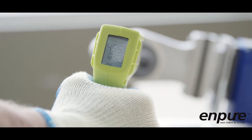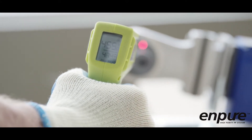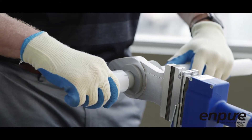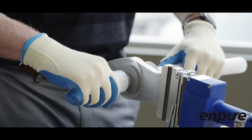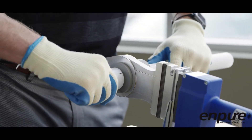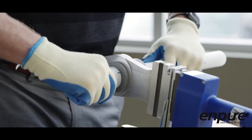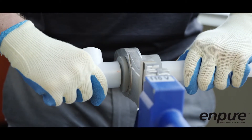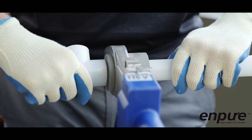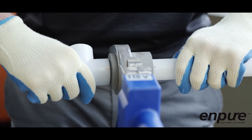Overheating or underheating of the pipe and fittings may result in poor fusion. Simultaneously engage both the pipe and the fitting with their respective bushings to determine interference. If substantially more resistance is offered by either the pipe or the fitting, begin your insertion with just that one item. Start the insertion of the second item once the first has reached the bushing half point. If the same resistance is observed, start both the pipe and fitting insertion simultaneously.